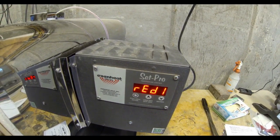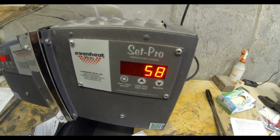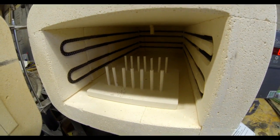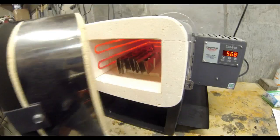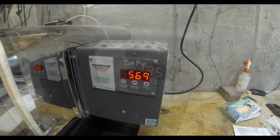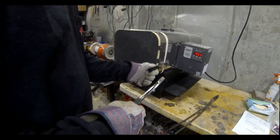RED1 is the abbreviation for Ready. In order to start the oven and start this cycle — the tempering cycle — just hit the Enter button. The next number on the screen is the degrees that your oven is currently at, the ambient temperature. Inside the oven I've got my ceramic rack in position, ready to accept the knives for heat treating. This oven will then cycle up to that set temperature at its full rate — we set it to achieve 1975 as fast as possible. It probably takes about 10 to 15 minutes to get up to temperature. Once it's at temperature, it will toggle between the temperature it's at and a countdown of the number of minutes it's going to stay there.